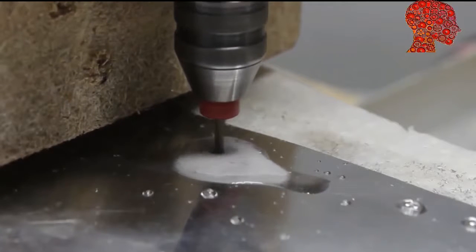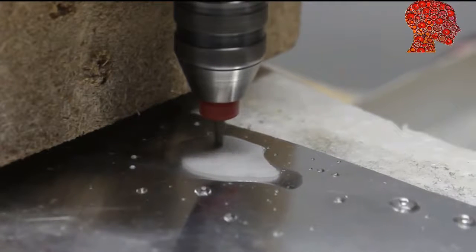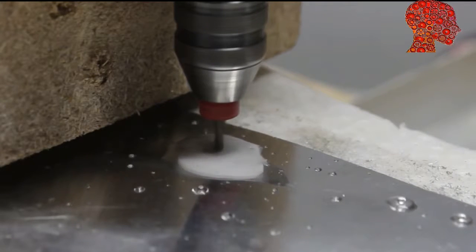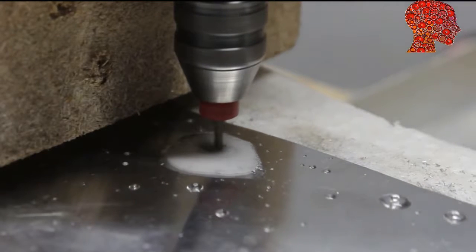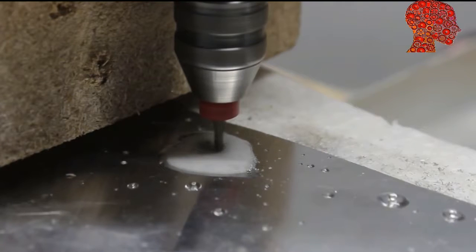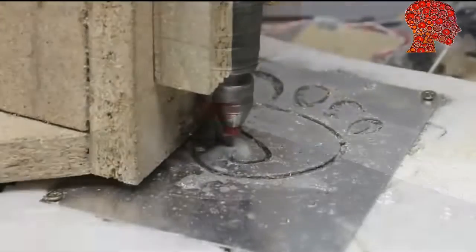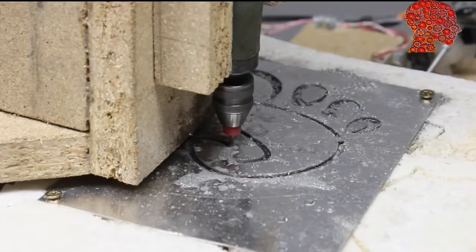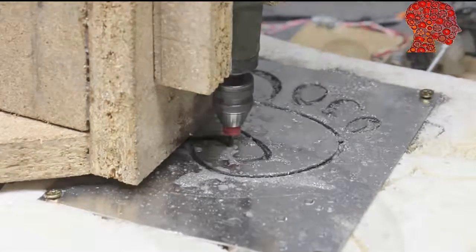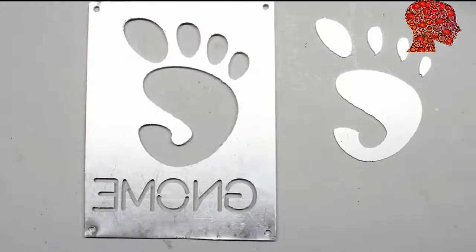What about more solid materials? Here I am cutting a 1mm aluminum plate. For this machine, aluminum is heavy metal. The mechanism is bent clearly, and as you can see and hear, the router sometimes vibrates heavily while cutting the material. Mainly the movement along the vertical axis causes improper cutting lines. The result is eventually acceptable, but definitely not very good.